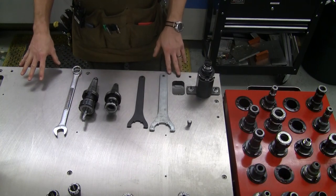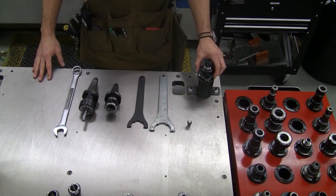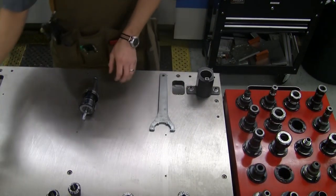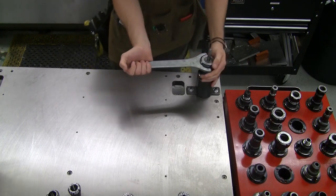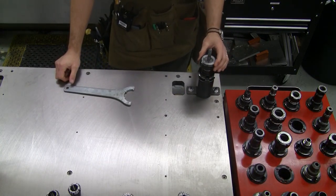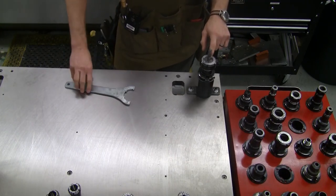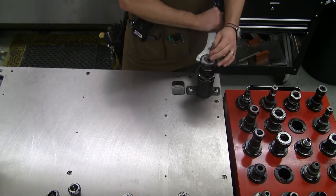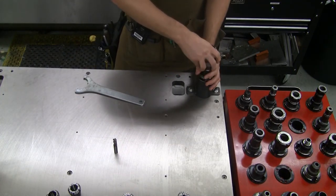All of these tools are available at the tool loading stations in the center of the CNC area in the red toolboxes. Disassembly is just the exact opposite: done machining, clean it all off, bring your spanner wrench, and break it loose. As you loosen the nut you'll get to a point where it tightens up again — that's where the collet has friction-locked. Grab the spanner wrench again, snap that loose, pull out your tool, and take the system apart.